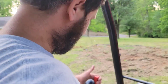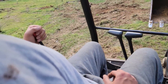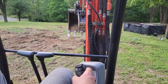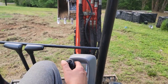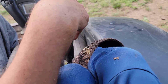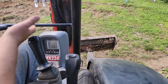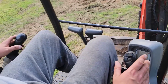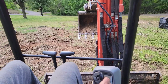We're going to start the machine together. Remember, pull this up, then turn the key. Now push this back down. Now we go out, back in, control our thumb by using the aux. Now we can open that thumb. Now we can pull up our blade, push the blade back down, pull the blade back up. Once you've got your blade up, you can fold these out right here and put your feet down. If you push both pedals forward, you're going to go straight, and then you'll go back — or you can use your hands.